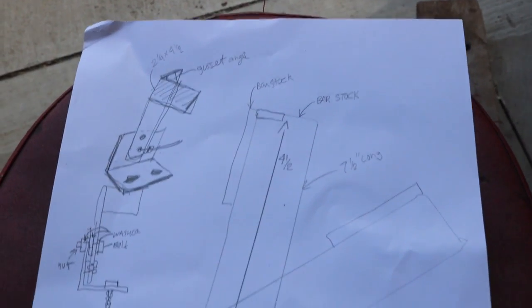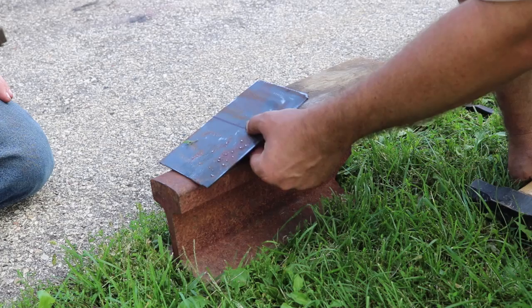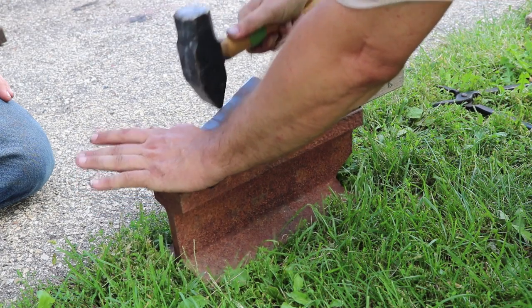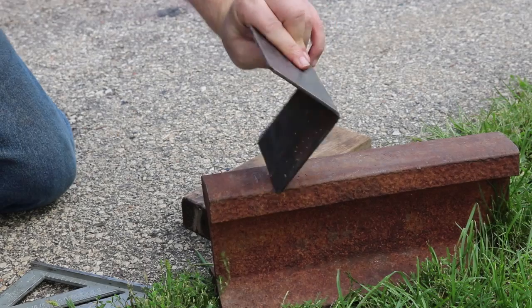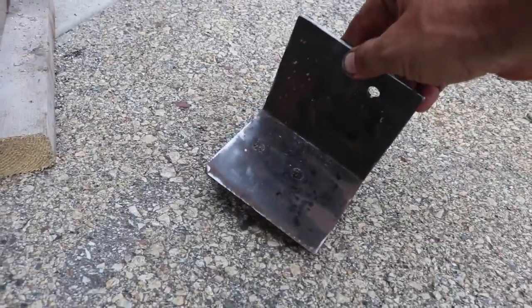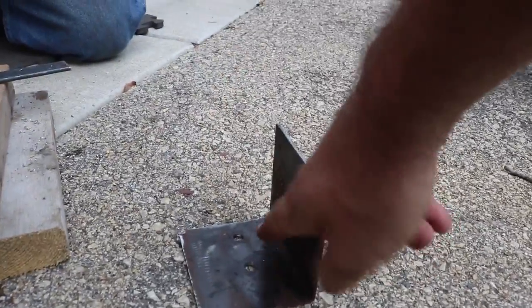So here is the plan for building a foot pedal, which will connect to a brake cable going up to the throttle in the tractor. We needed a large L-bracket — something I didn't have — but we did have some steel plate, so we cut that to length. I didn't even have a vise, but I did have a hammer and anvil, so we marked a line, scored it, and used the hammer to bend it to 90 degrees to make a big L-bracket. It took a little time but turned out very nice — there's our bracket, and then that lever is going to go on the bracket and pivot!